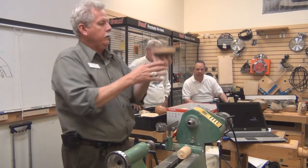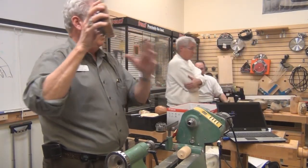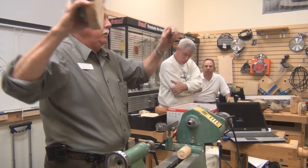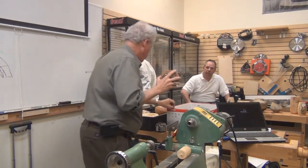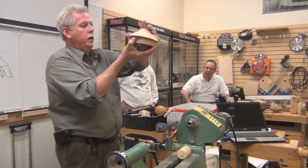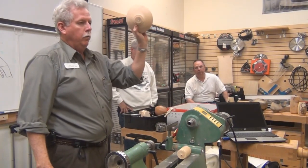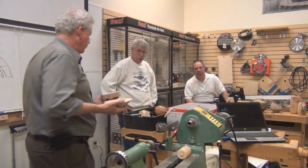Tape chuck. I had this up but I didn't talk about it. I've had this thing for seven or eight years and I've never done anything with the wood - all I do is use double-stick tape. Don't buy cheap tape - buy the good stuff, buy it from a craft supplier or Woodcraft or somebody. This has been on here three months and you can see how hard it is to pull off - it's still got plenty of tack. So a tape chuck - you mount this in there, bring the tailstock up, press it in there hard, let it sit for five minutes and that tape will grab into it. Pull the tailstock away - now you can do the foot. It will hold, trust me. Just have to be careful because you will have tape residue that gets inside your piece.